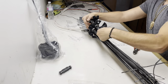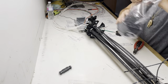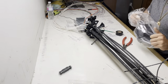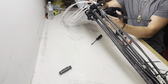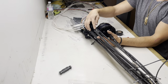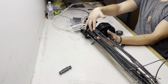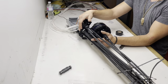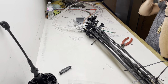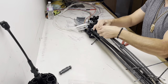Forward. You want to get the proper measurement before you even put this on. Do this, simple little trick. If you don't know how far to push it forward, this little piece is going to go inside of that, and it's going to sit flat, flush with right here. So these need to be in the direct center of this gel pack for them to seal properly. So you can literally just line it up on the side. Boom, get your measurement. Now you know. When you put that on, it's going to be good. Always use a little bit of tape. Keep this back in the exact order it needs to stay in until later on.